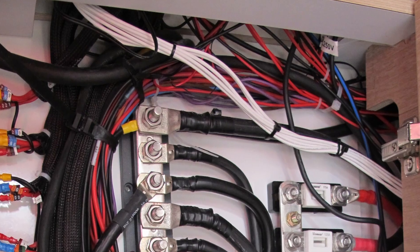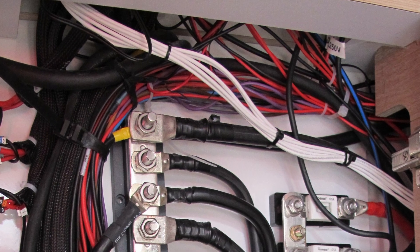And it doesn't just melt down where the short circuit is — the amps are going through the conductor to the point of the short circuit and back to the battery, or on an AC circuit back to the AC source of power. So the entire conductor run is seeing that high amp flow, and then the entire conductor run melts down. And if it's in a bundle with other conductors, it melts all the other conductors, and then we've got multiple short circuits on the boat.